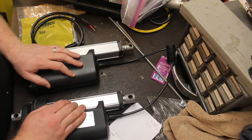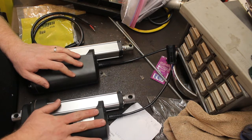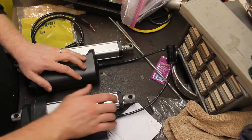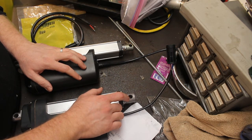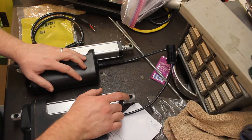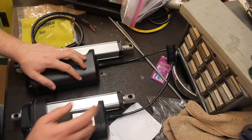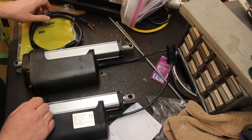After quite a bit of discussion with Progressive Automations — this is where this actuator came from, and undoubtedly where the Deere version came from — they could not make the pin a three-eighths inch like I wanted. The smallest they could do is a half inch. So what I'm going to have to do is bore the openings out on the quick attach. Not too terrible, not a big deal.